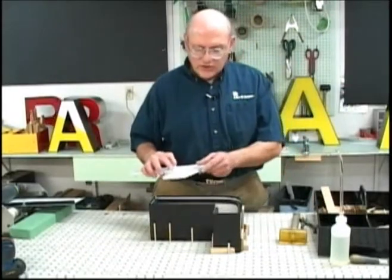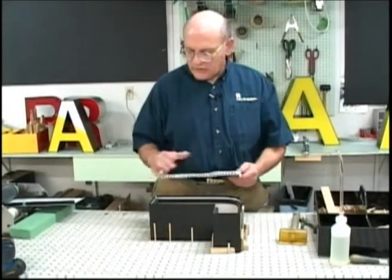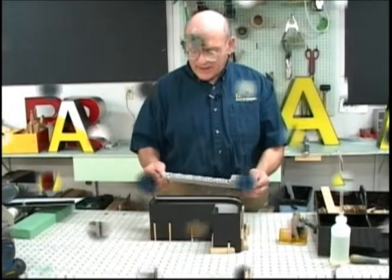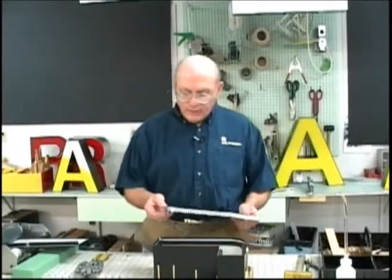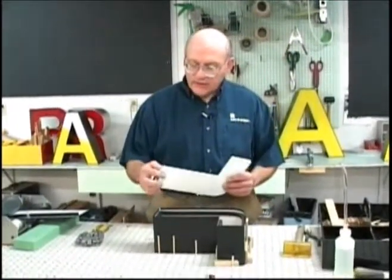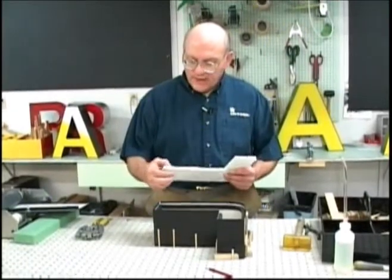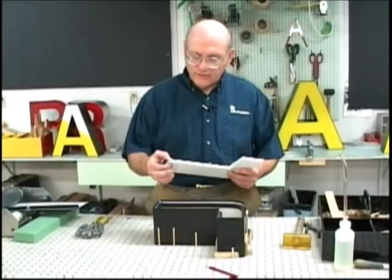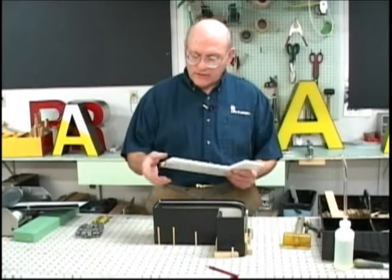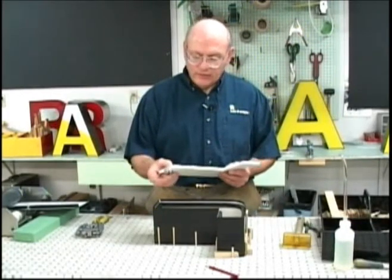Then we use L-shaped clips for every point where the screw is going to be used to join the face and the back. So the L-clip on the Alumicor at one point is through bolted, and the reason for that is that the Alumicor has 2 surfaces of aluminum separated by a plastic, and so to bond those 2 surfaces together, we through bolt the L-clip to that.